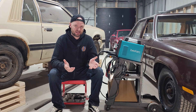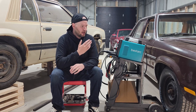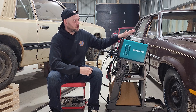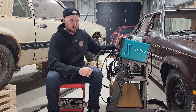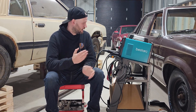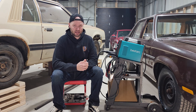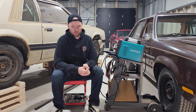I blew the breaker again — this is embarrassing, but I've got to own up to it because it was my mistake. When I got this thing I didn't look closely enough at the power requirements. This shop isn't totally finished — I've only got 15-amp breakers in here, which I thought would be enough to run my welder. This thing needs 30 or 40 amps on 110, and even more on 220 — I don't have that here. I'm going to hang onto the tool because I'll finish wiring eventually, but to finish testing I spoke to a neighbor who's got 220 and bigger breakers.